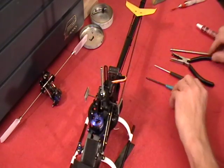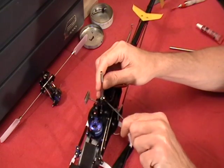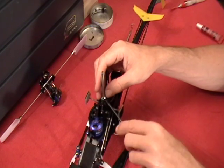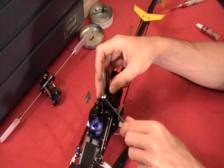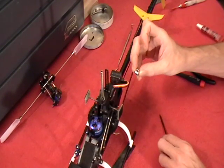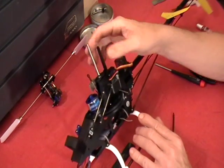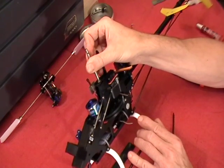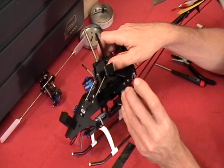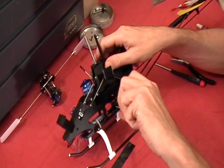Next we have our collar. I'm going to back out the Allen screw on the collar — I don't want to back it all the way out because I don't want to have to keep up with it. If I leave it in there partially it will stay put. We'll put that in our bin. Now last but not least we have the bolt on the bottom. I'm going to rotate the shaft so I can see my Allen head working down below the main gears, and that nylon nut should hold long enough for me to start backing it out — and it did.